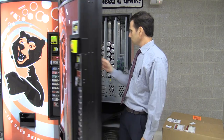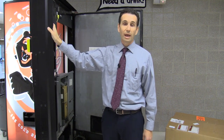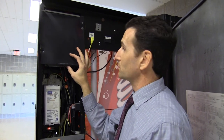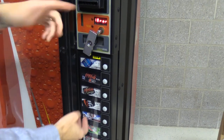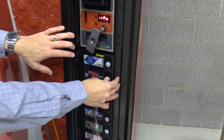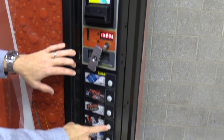One way to troubleshoot is to go into the service mode of the control board and test the relay. There is an option in there to test the relay and make sure it's working and kicking on that cooling deck. On this G3 machine, you go up to the control board and press the little blue button. Navigate through the menus using the second button to go up, the third button to go down, until you find 'Test,' then press the fourth button to enter.